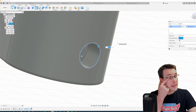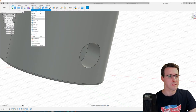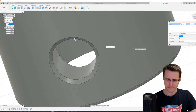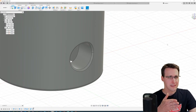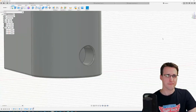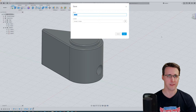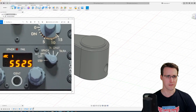I think I have read that chamfering is better for 3D printers than fillet. I just remember now when I want to do this here. Let's try a really small chamfer. Why do I do this chamfering? It's easier to insert the set screw or the thread cutting tool later than here. Yeah. There it is. Save. Transponder. Wow, this was fast. Cool.